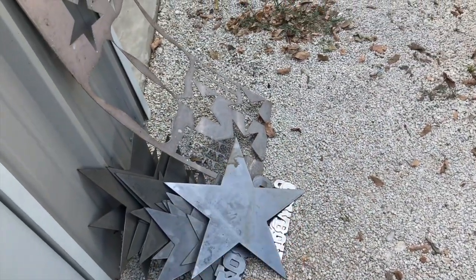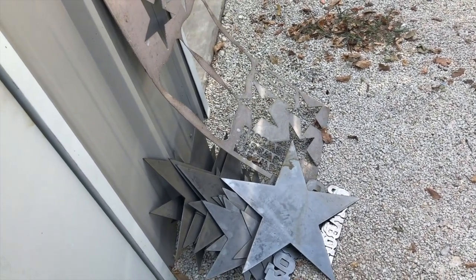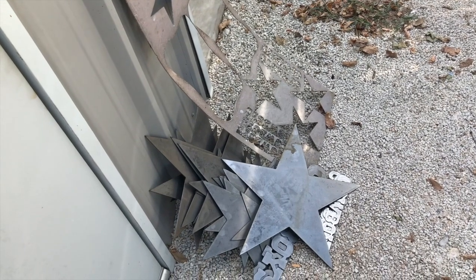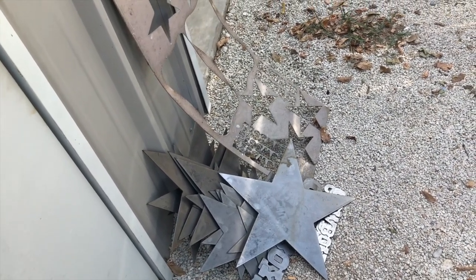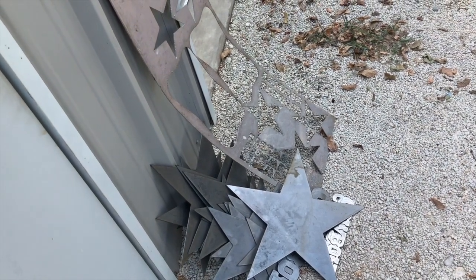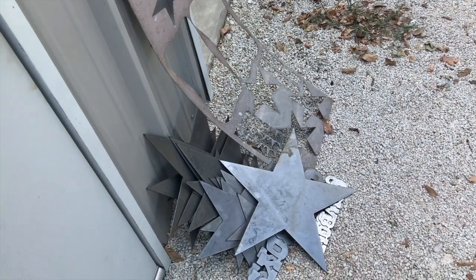On larger parts that don't have a lot of detail, you can run that at 600 inches a minute, no problem at all on a TrueCut machine. There's a link in the description of the video if you don't know about TrueCut — go check them out. They've got a lot of industrial tables like the one I'm running, starting in the range of about $10,000 to $12,000. Really good value, great company, great support. See you guys.